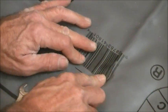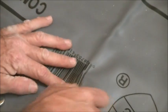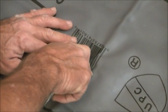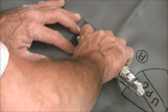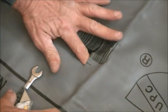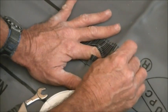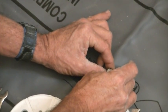When you feel around this opening for your drain, you can often see the indentation of the hole. I take a razor knife and go almost to the edge — about three-quarters of an inch off — and bring a cut all the way down, then do the same on the other side. I make a small perforation on each side to form a little X. You'll see other videos where the person puts the bolts in first, then searches for the bolt head and pushes the pan liner over it — that stretches out your pan liner unnecessarily.